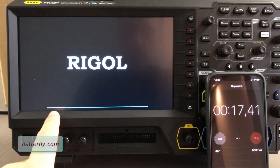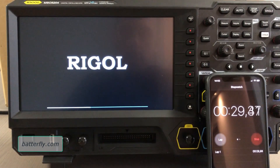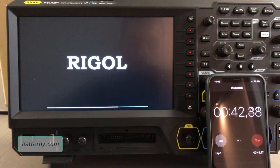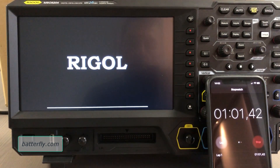So probably from the video you cannot see very well, but you can see a loading bar. In the meanwhile, we note the models available: we have six models — 70 MHz, 100 MHz, 200 MHz, 350 MHz. The 70 and the 100 MHz come in both two and four channel variants. You have a standard 100 mega points of memory, upgradeable to 200 mega points, and eight giga samples per second sampling rate. When using a single channel it's eight giga samples, dual channel interleaved is four giga samples, and for all active channels it's two giga samples. In the meanwhile we are almost there.